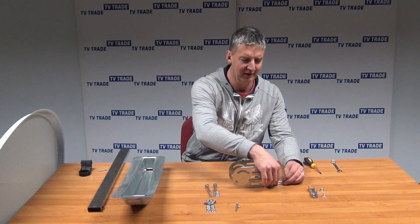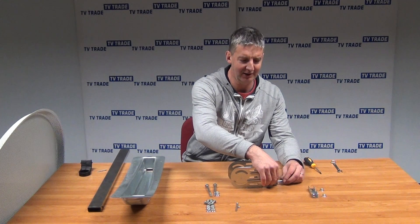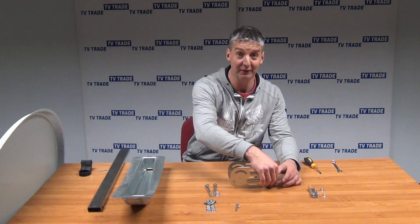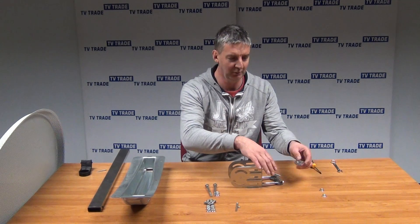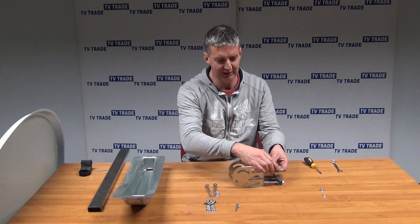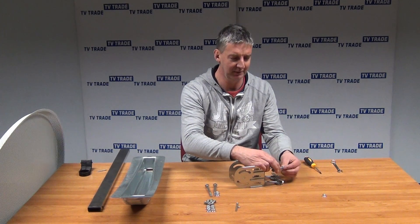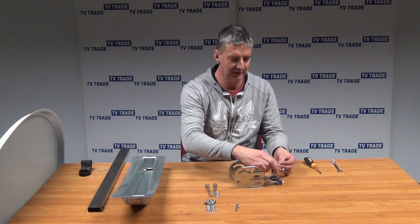The standoff on it all depends on the type of angle you're going to need the dish at. But the standoff would ideally be at least 55cm, to get us out that distance from the wall that we need to have a full 180-degree rotation on the dish. So it's roughly 120 divided by 2 — that's really how you're calculating it.